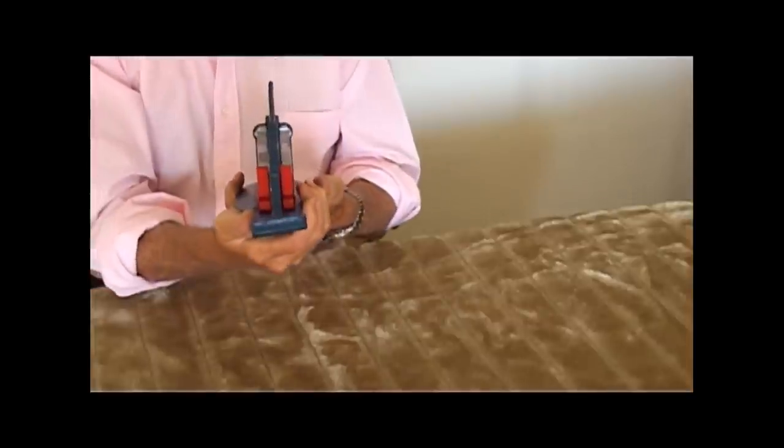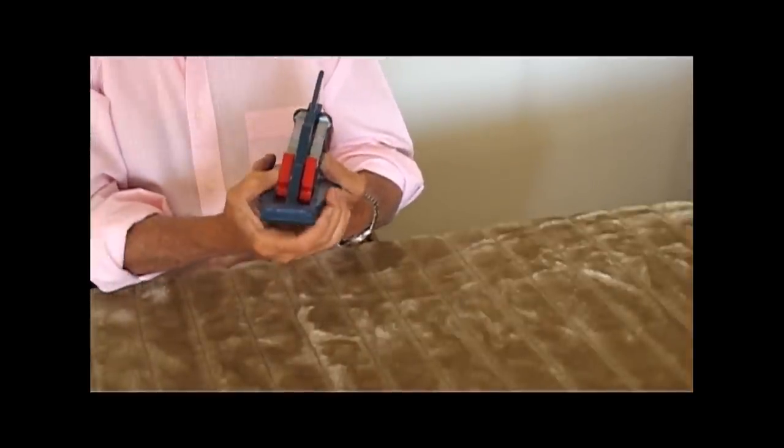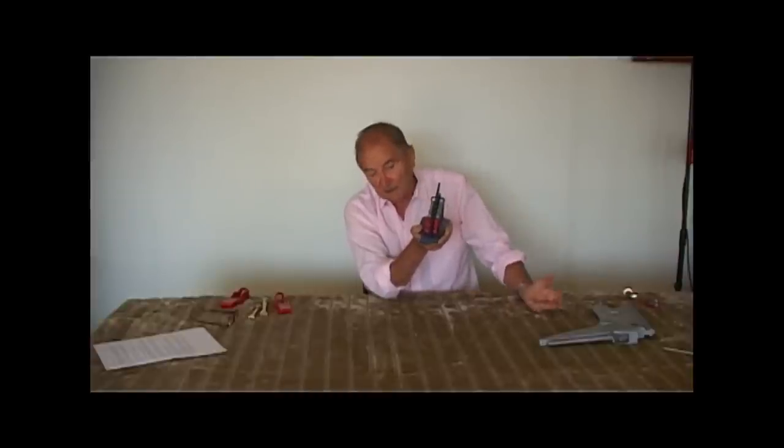What the ground is looking at is a face across there. Imagine you're going through the ground — a face across there — and that's a tungsten carbide insert that's embedded in the front of the point. There are two tungsten carbide pieces that sit there and there. You know tungsten carbide wears extremely well, so they will last a long time.